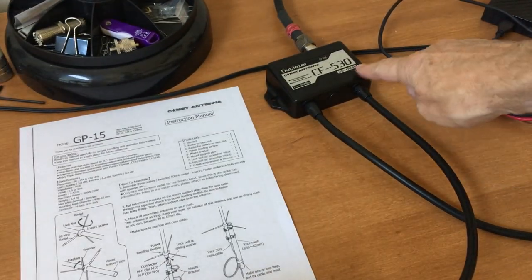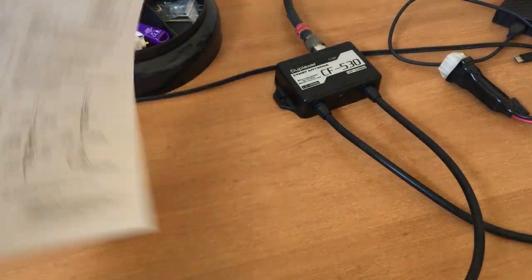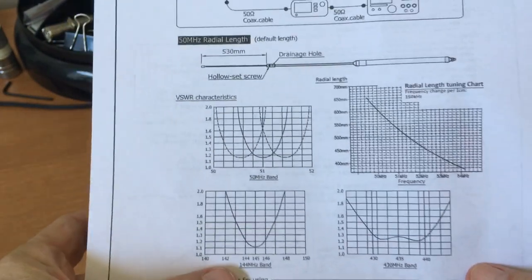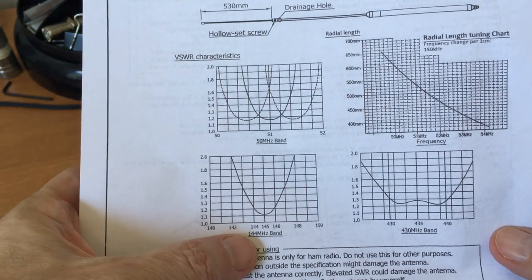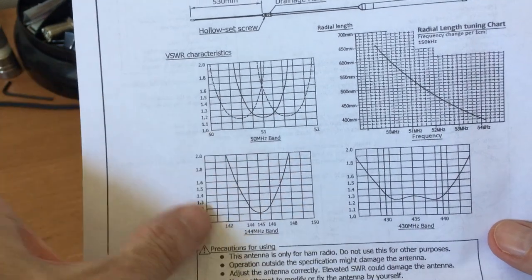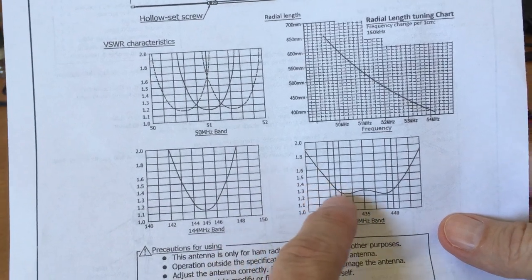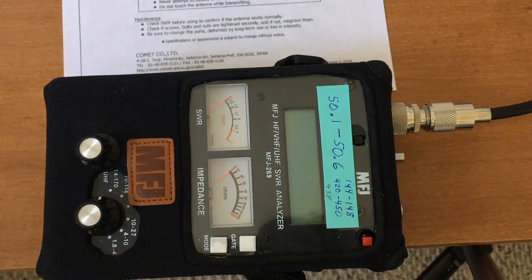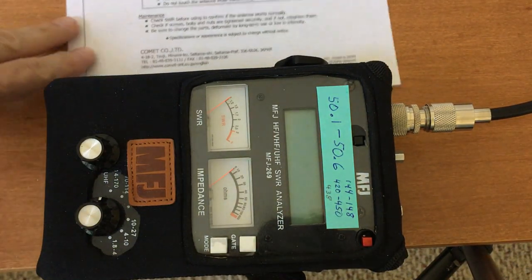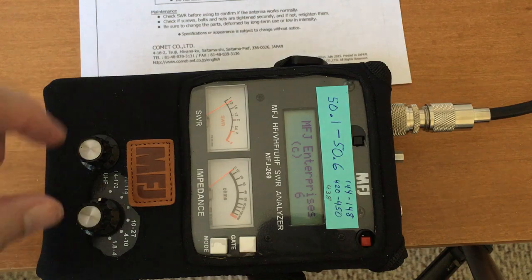I've got the 125 to 470 MHz side selected — let's see what those look like off the antenna. We've got the 2 meter, which is just an arc, and on 440 (70 centimeter) you see it goes up and down. We want to take these readings near the radio because SWR is about the radio. I'm going to turn my meter on and rotate the video so you can read it right side up.